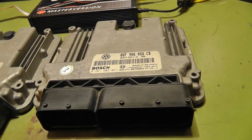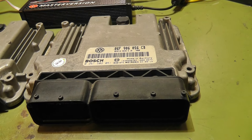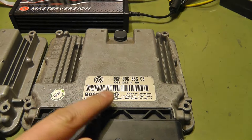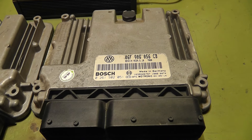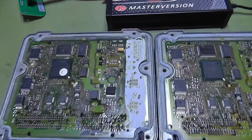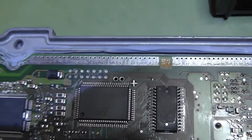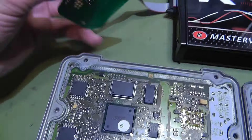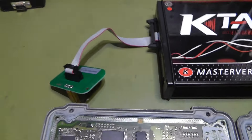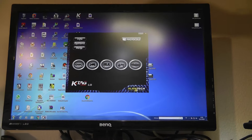I should be able to connect the replacement unit to the car without programming — plug and play. I do this also because I have no login code for this replacement unit; the scrap yard was not able to provide me this. Now I open it up and this here is the BDM port. Unfortunately I have no BDM frame, so I have to hold this connector with my fingers down. I don't like it but I have no other choice at the moment.